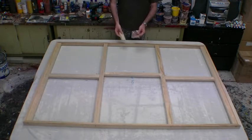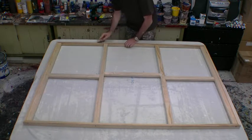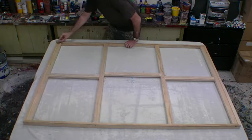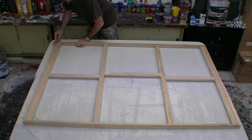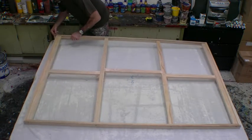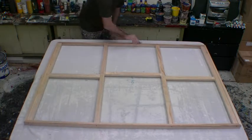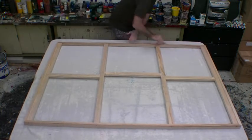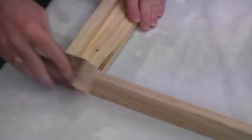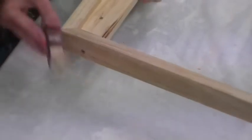Once we're finished putting the frame together, get some sandpaper wrapped around a bit of scrap timber and sand off all the sharp edges right around the frame. The top and bottom of the frame — the corners especially — need to be sanded, because those sharp edges can end up tearing your canvas when you're stretching it across. Be very careful that all sharp edges are off. I round off the corners especially — I don't want them sharp where they can dig into the canvas and start a tear when you're stretching it.